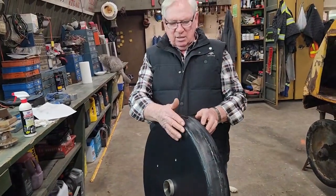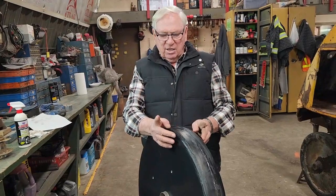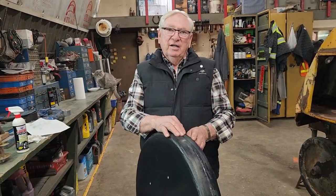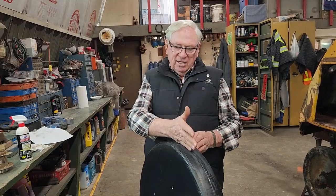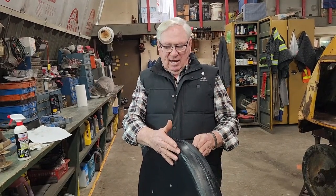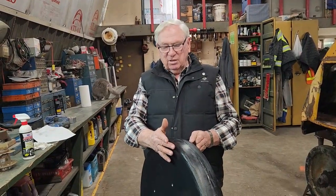The cleat, this is wider than a normal wheel. Yeah, because I've made it so it touches the outer edge of the cleat a little bit more, so the pressure's not in the center. Or if you're going down a trail in the spring that's got a rut left from a previous sleigh, you don't put the pressure right in the middle of the cleat, to stop cleat breakage. I won't say it stops cleat breakage, but it resists them breaking because it puts the stress out on the cleat more.